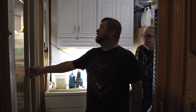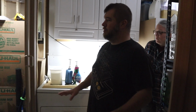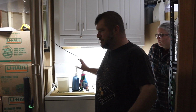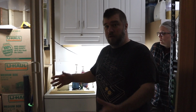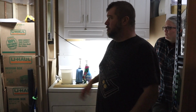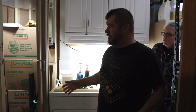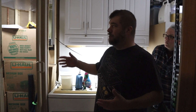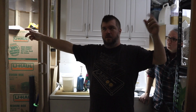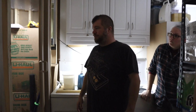So underneath these bathrooms, I left everything open to the furnace room. I've got some small other vents that are going to go in here, but I'm using this space inside here to pull all the air for our return air into this space. So we'll have return air coming in underneath the bathrooms, and return air coming in from the front and back over here on these walls as well. Everything was designed with the mind to keep it minimal. We just have ductwork going up to the top, and then it's kind of like a T, and it goes to each space to heat each space. So it's very simple, but very effective for us.